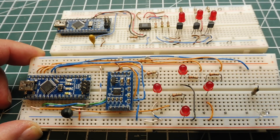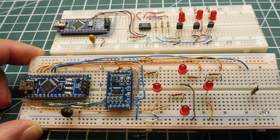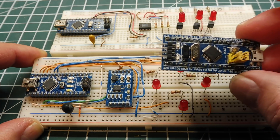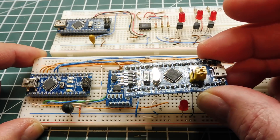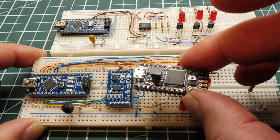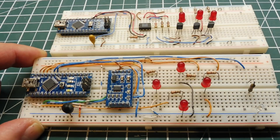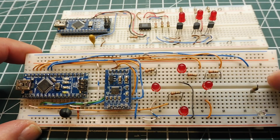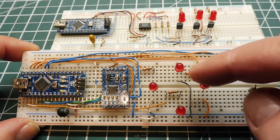In this video we are going to look at prototyping with Arduino Nano. I'm not going to restrict it just to the Arduino Nano — it could be an ARM microcontroller like on a blue pill or on the ItsyBitsy, so it could be any microcontroller module. The first thing we do, we take our module — in this case Arduino Nano — and mount it on a breadboard which has an isolation channel through the center.